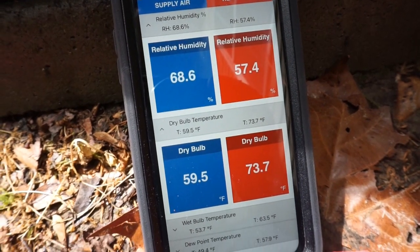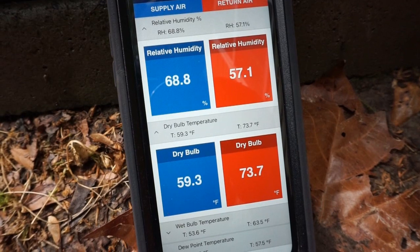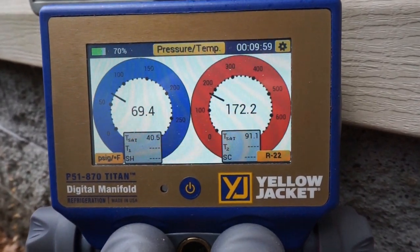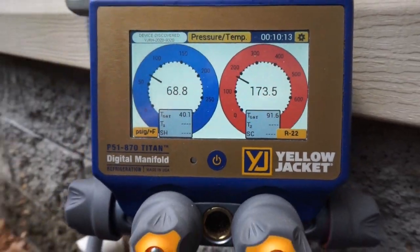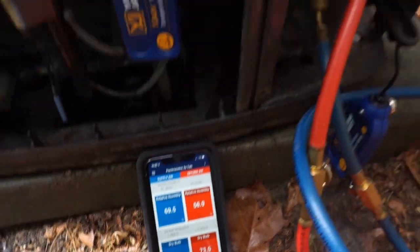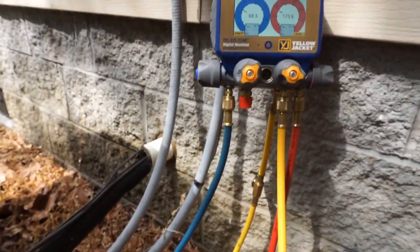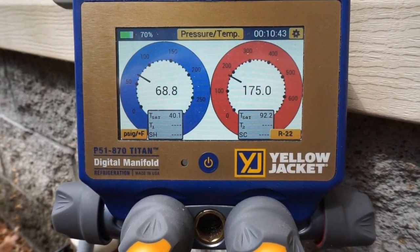About 5 or 10 minutes go by and we have a delta-T of just over 14, so we're building in the right direction. It hasn't quite been that full run-in time where you'd expect steady-state operation. Relative humidity is 69% on supply and 57% on return, so it's coming down. Our pressures are building up a little bit on the head pressure side. Suction pressure and temperature are being controlled by TXV, so suction pressure and superheat. These are the Y-Jack probes I have in place — the Y-Jack wireless temperature clamp. The one inside is called the Y-Jack Dew, and there's a range extender which I've never actually had to use because I work on little residential stuff like trailers, mud huts, and yurts.